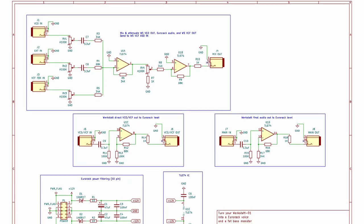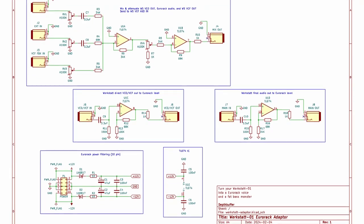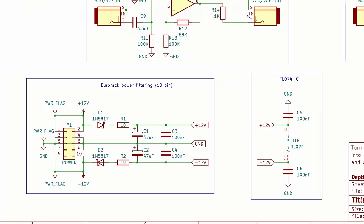So here's the final circuit, broken down into 5 blocks for legibility. Down in the left here we've got the power input, with our 10-pin power connector, a couple of diodes for reverse power protection, a couple of 10-ohm resistors that will act as slow burn fuses if there's a short circuit anywhere, and a couple of large and small capacitors to filter out any peaks and troughs or high frequency noise